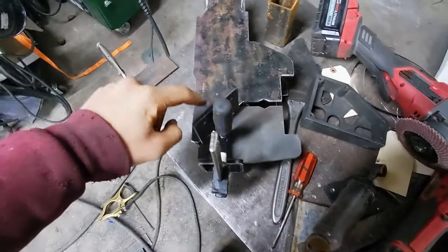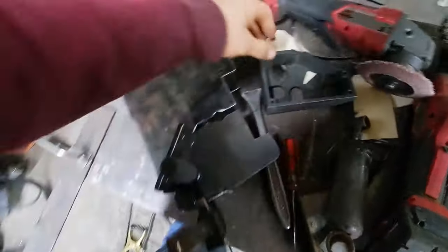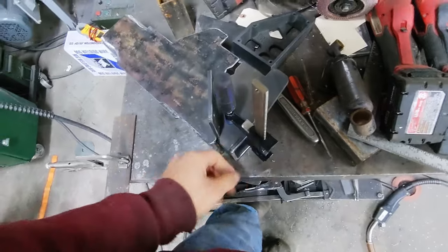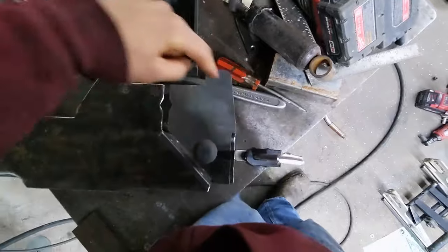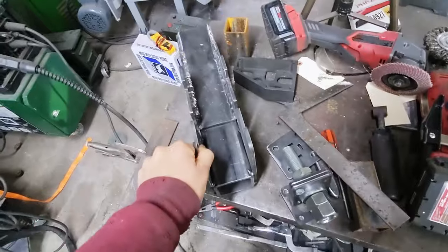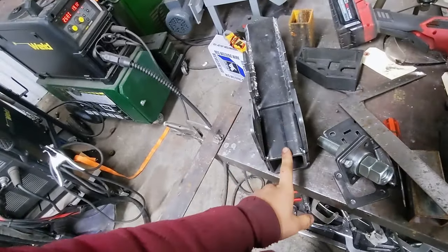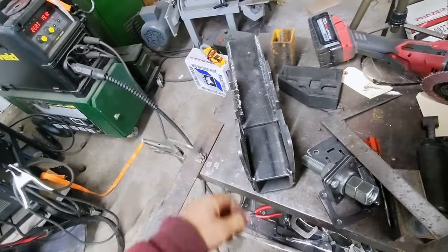I think I'm going to weld this up in place right here, just with a spacer in here to align it so I don't hit the corner, because my parts aren't perfect. That way I can put a straight edge on this surface to make sure the jaws will be exactly the same height when the vise is done. Just clamp this — it's supposed to be flush with the end here to give a little room for welding. Tack that up and see what it looks like. You want the square part of your tube to be at the front; the back side of the tube doesn't matter very much.